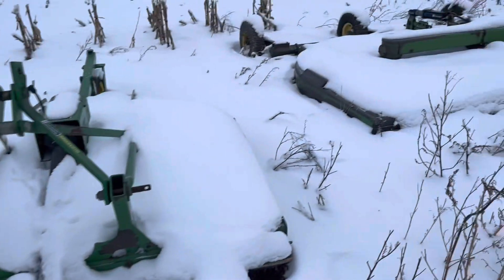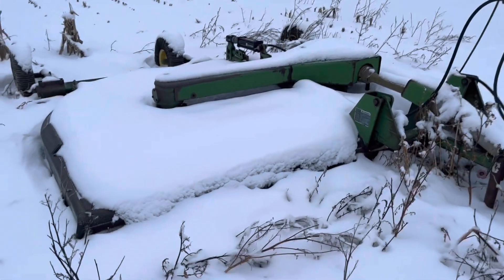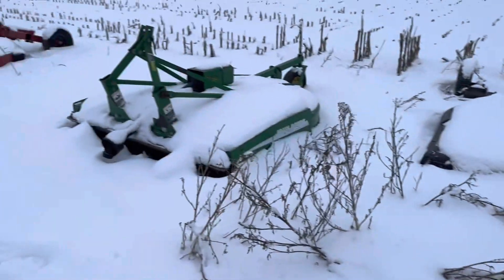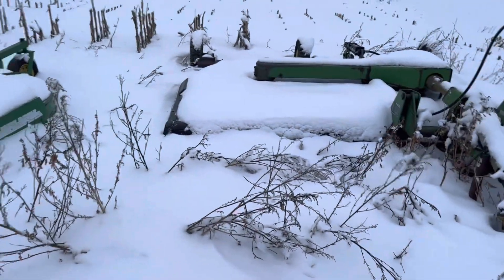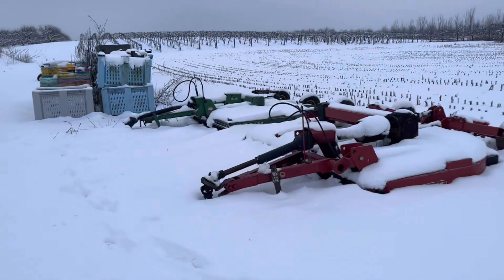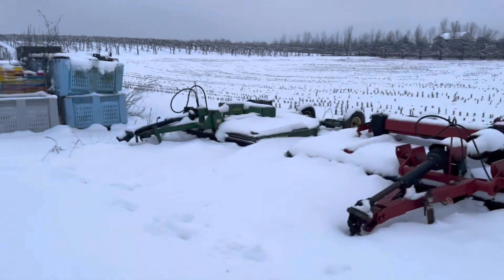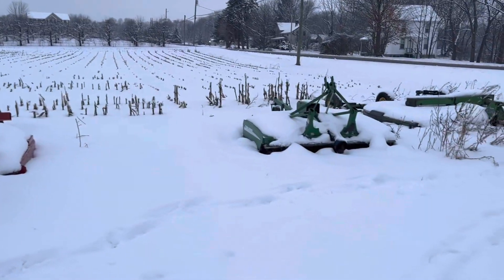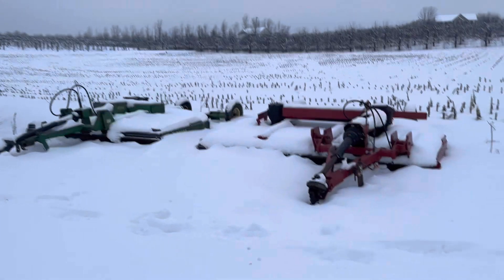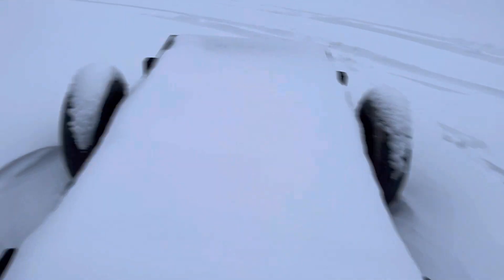This MX6 six-foot rotary chopper chops brush in grapes and mows grass in the summer. We have a John Deere 1018 ten-foot offset — we use this for mowing grass; the housings are smaller and it works perfectly. In total we have seven choppers right now and are looking at getting one more straight-pole ten-foot chopper for apples due to our larger spacings. The one thing we're really missing is a flail chopper — we've never had one. We have a brush pusher for what we can't chop; we push it and burn it.